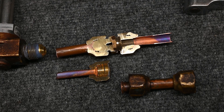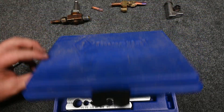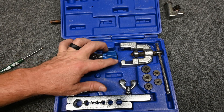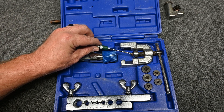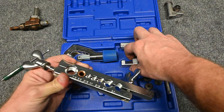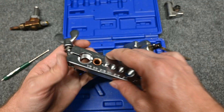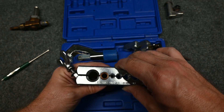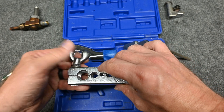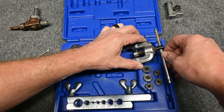This is not a how-to video, but let's talk about a few different tools we can use to make this flare fitting. The most popular tool forever and ever was this Imperial tool kit. It comes with tubing cutters, a flaring block, and a flaring tool. Notice how we have this cone shape — that cone shape is what makes the cone of our flaring tool. This block holds the copper, this other piece latches on, and when we screw the thread down, it adds pressure and makes the copper flare out. This one's not done straight or square — the length inside the flaring block is very important, as well as the type of copper and centering everything up.